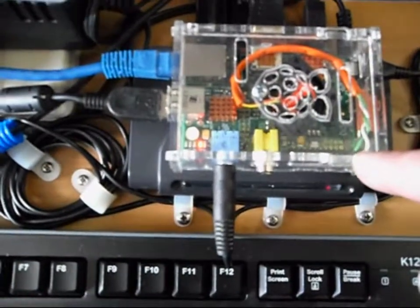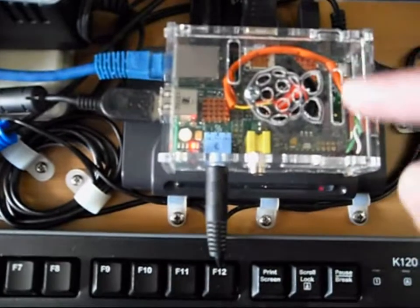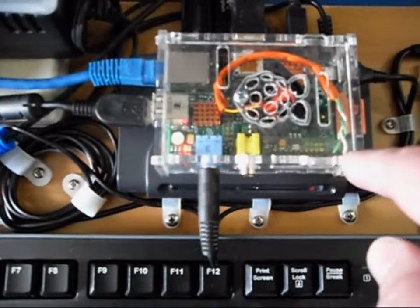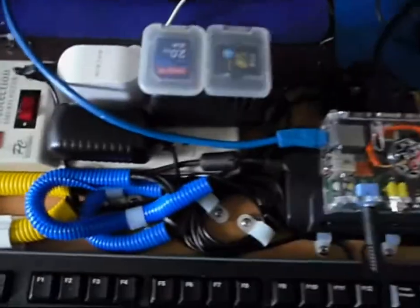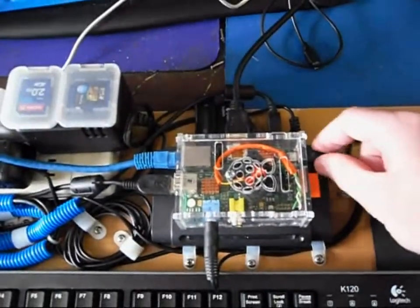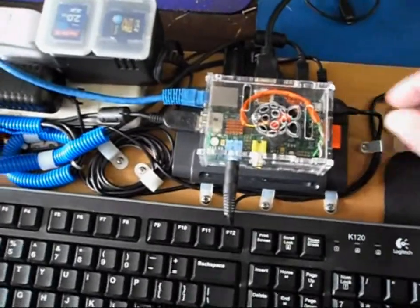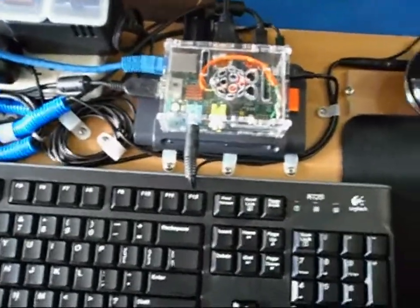This is a continuous 5 volts coming from here. Your board only uses 3.3 volts, so there's a continual wire off this GPIO pin assembly here. So technically this is my off and on over here, so I'm not unplugging and unplugging wires like that. I don't like that. It's like your cell phone charger. After a while, you keep doing that, then it don't work no more.